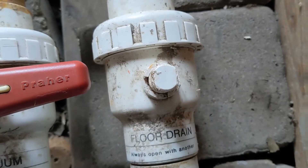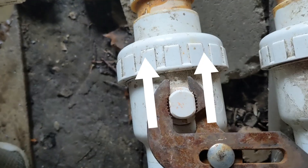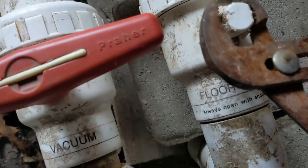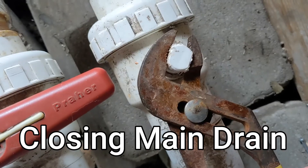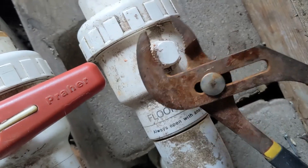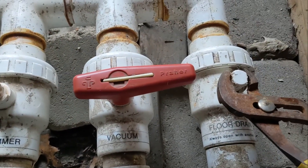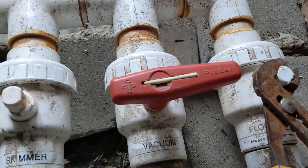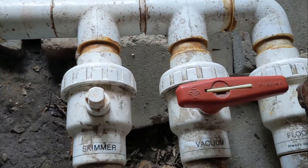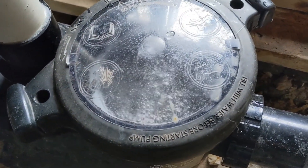The handle came off, so the flow is going straight. If we turn it, you can hear it straining when we turn off the valve. It's just coming out of the skimmer — it's pulling from the skimmer. So we know that something's caught in the skimmer.